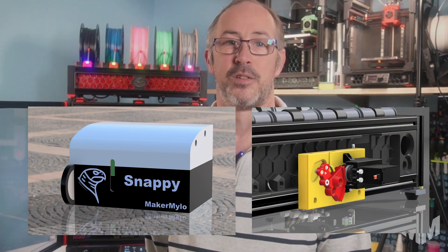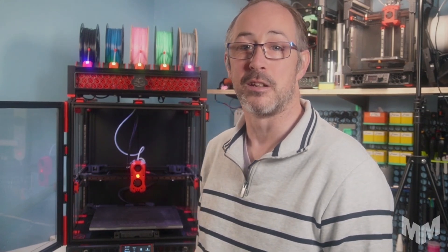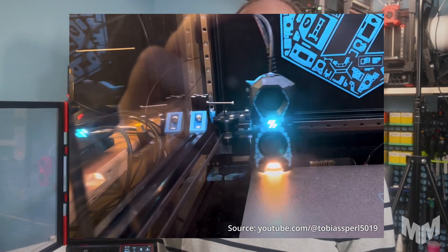It's at this point where I created my first modification, and it's one that I've seen used by the vast majority of beta testers. Dubbed Snappy — after the Snapping Turtle moniker — this is a servo-based filament cutter based heavily on the EREC filament cutter designed for the ERCF. Adapted to simply screw into the back of the Box Turtle, and just needing power and a spare GPIO, Snappy adds the ability to cut the tips off your filament before loading them into the tool head, ensuring that you won't be pushing a deformed tip into the nozzle, potentially causing a clog. Some users opt for the Filametrix design, which adds a cutter directly to the tool head. There are also developments ongoing amongst the Box Turtle team to design a purpose-built filament cutting tool head designed specifically for multi-material use.